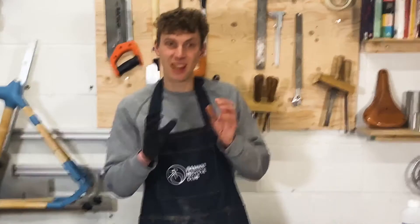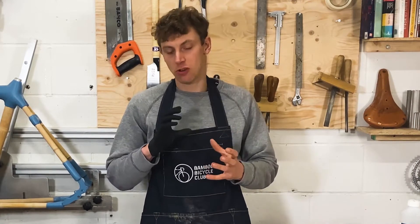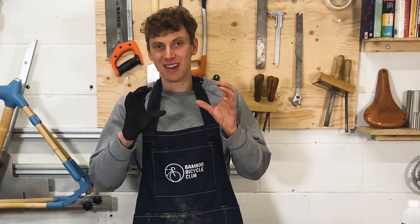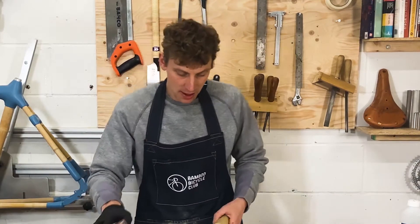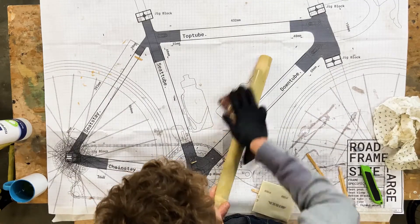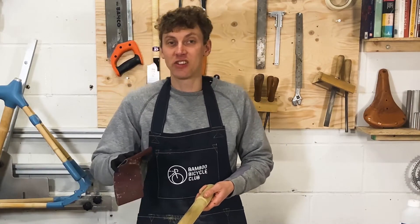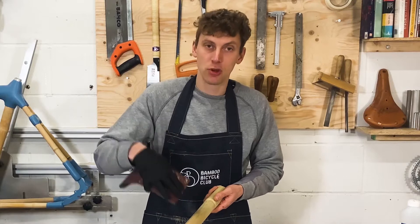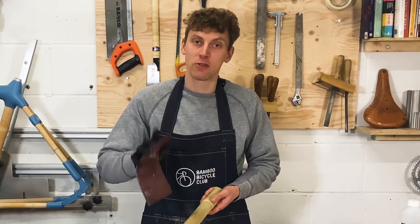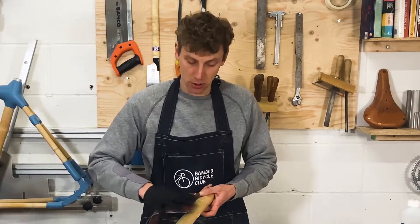The next stage I'm going to show you how to create a nice stain on your bamboo. You can use a natural wood stain or a paint stain — it's going to allow the grain to come through the bamboo but give it a different color. The first step is to sand off the bamboo and remove that top skin. By taking the top skin off you allow the bamboo to be more permeable so you can put paints and stains on, but you must apply a lacquer once you've finished staining to seal the bamboo off again.